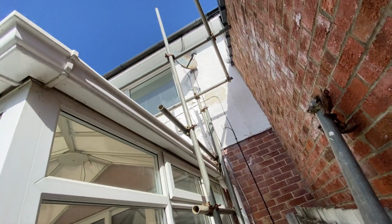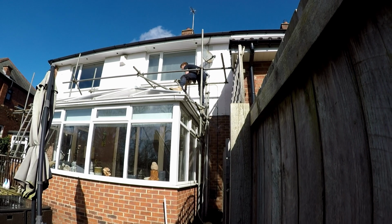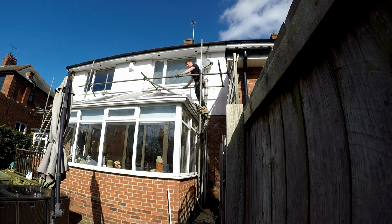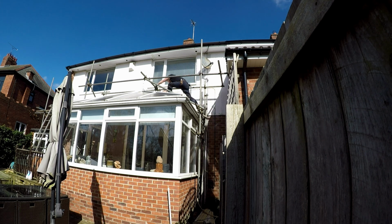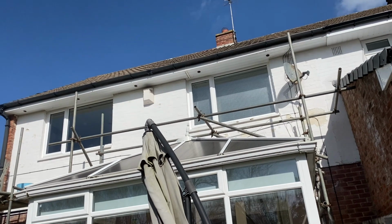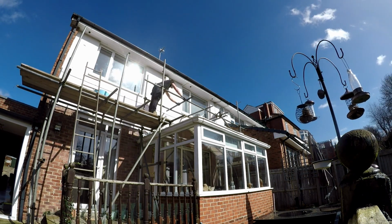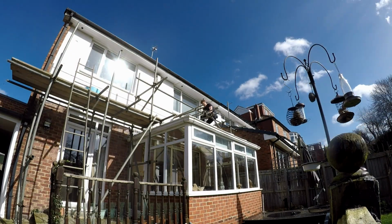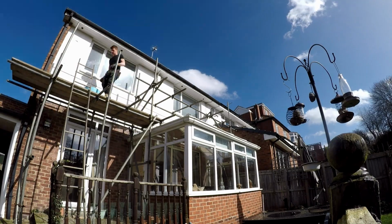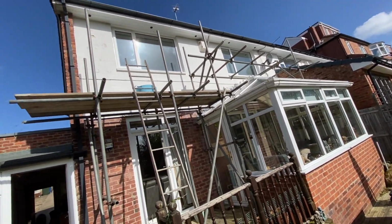That's my two rakers I'm going to put in. This should be interesting. Right, they're in. I won't know how effective they are until I stand on them ledgers. That was quite awkward. Right, what do I need now? Some transoms on there, get some boards on. Okay, all the transoms on now, get some boards on it. Puncheon, handrail, that'll be it done.